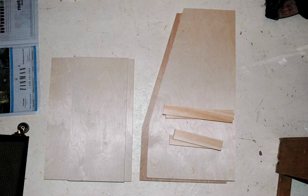So I ended up with these pieces. Make sure to check that your cuts are square, because even small mistakes here will be trouble when you're putting it all together. You can also see that I cut some 1x2 strip that I had laying around — two to fit within the depth at the bottom of the rack and two to fit at the top. These will be used for extra support in the corners and help to keep it square.